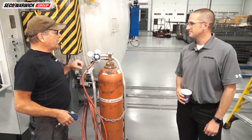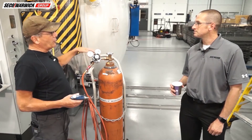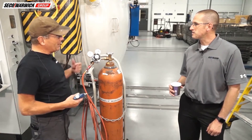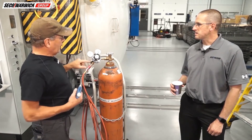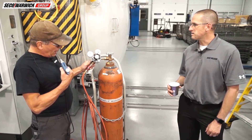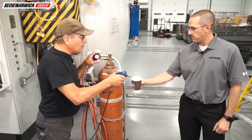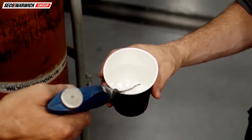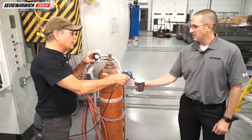While we're waiting for the leak detector to settle, we're going to set the flow of the helium. We don't want too much flow because it drifts — helium is lighter than air and you'll end up thinking you found a large leak somewhere when really the helium drifted over. I've got a pressure regulator and I'll check it in the water — what we want is just a few bubbles and not much. That small amount of bubbles is all you need. The problem is you can't feel it, but in the water you can see it.